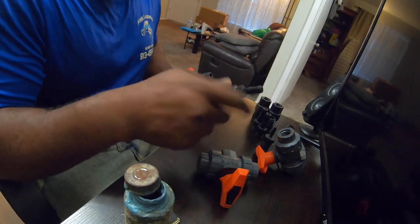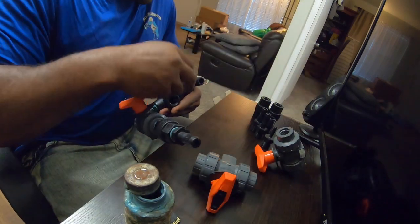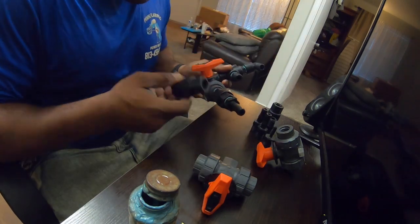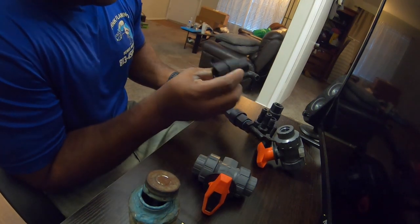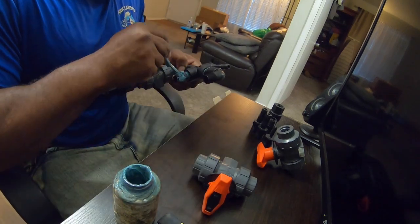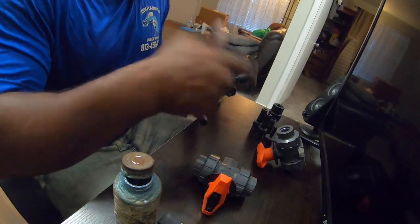Like I said you can do your soap in the middle — you can do it that way. So instead of putting the check valve up top, you put your nipple in first. It's arrow down, make sure your arrow is pointing down on the check valve. Put that in first instead of at the top. She's in — now you're gonna do another nipple.